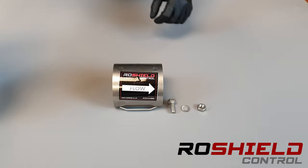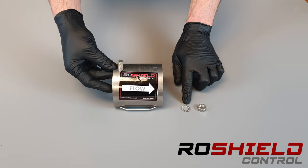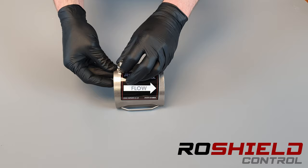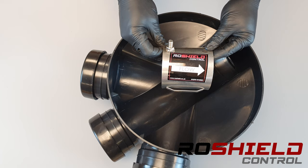Within the kit we've got a bolt, a washer, and a nut, and we're going to use these to stop the guard from falling through the drainage system. We're going to attach these at the back end of the flow. The bolt goes through, we attach the washer — that sits on there — and the bolt is tightened. It doesn't have to be too tight; just hand-tight will do. When we install this, as we'll see later in the video, this will help prevent the guard from falling down into the drain.